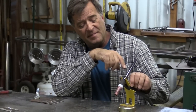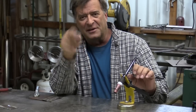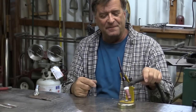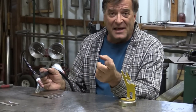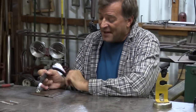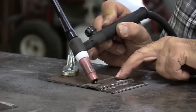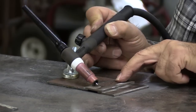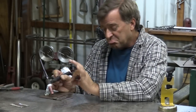I've got my flow meter set to about 10 liters per minute, and you just control it right there. You just give it a bump with your finger, strike, start your arc, and away you go. Starting the arc with this — I was wrong the other day when I called it a scratch start. It's actually a lift start. All you have to do is put your torch down, rock it over until your electrode touches, and pick it up. Just touch it and pick it up, and it starts — you should be able to hold an arc that way and get to work.